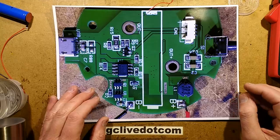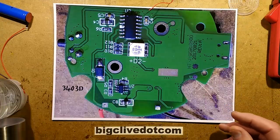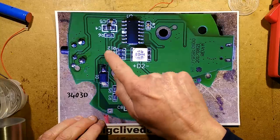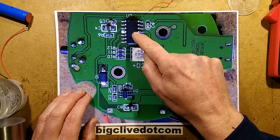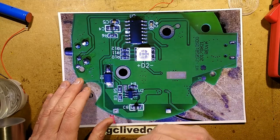It's very good. The power supply, and I'll jump over to this side, branches off two ways. One leg of the positive rail goes up via this 2.2 ohm resistor and a couple of different size capacitors to provide different levels of filtering, and powers the control chip. And this is the microcontroller. It's completely anonymous, as it normally is.